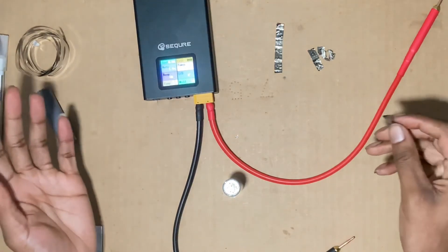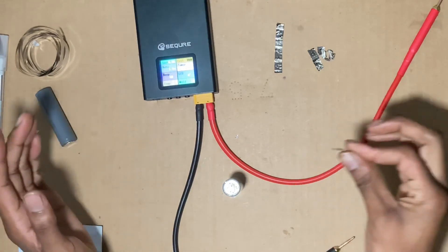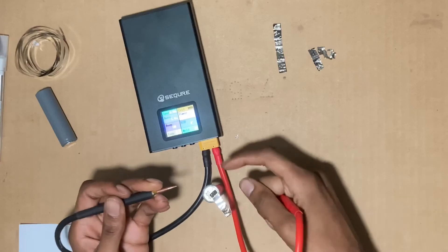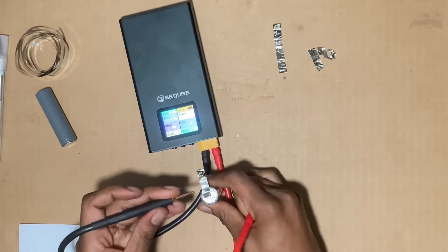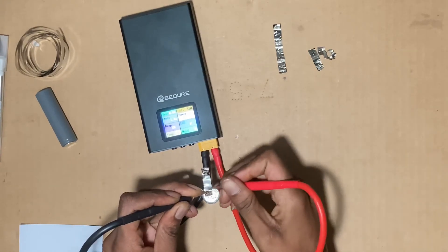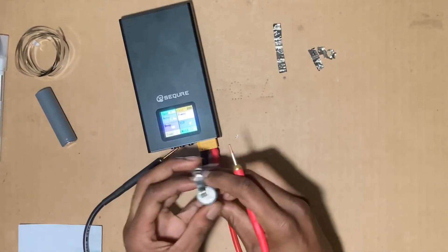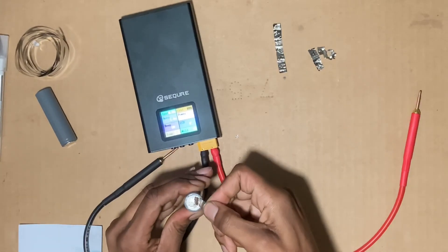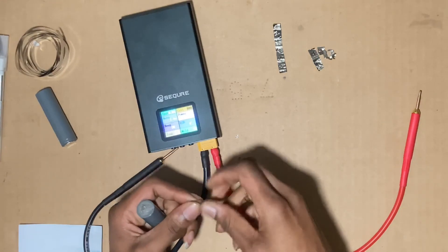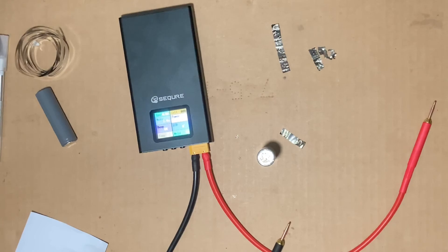Once I find an easy solution I'll let you know. I'm going to do a whole project with this device, so after a full project you'll learn more about it. Here's a tip: if you do a connection and the right side isn't solid, put the negative probe where the positive was and the positive somewhere else — still on the same strip. Now you get a pretty solid connection. This is at 50 and it doesn't even move — solid. It took a little force but it was solid.